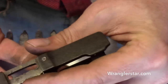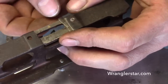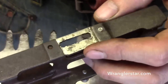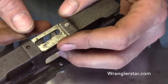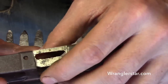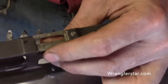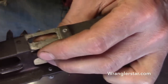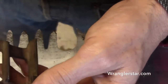The reason why you're not going to have to go through this process so much is once you get your tools all set up. This is a new tool, and who knows the history of it or what it was used for. Everyone has their own ideas, within reason, but people vary on different types of sets, 9 and 12 or 8 and 13. It's different for the different types of saws and also for the different types of wood. So this being softwood, this is considered by the best filers to be about right.